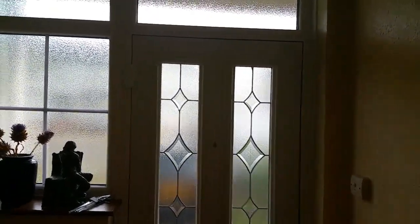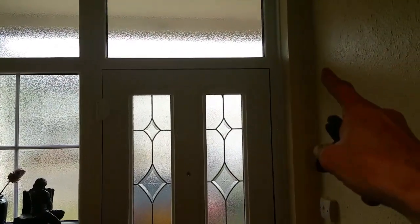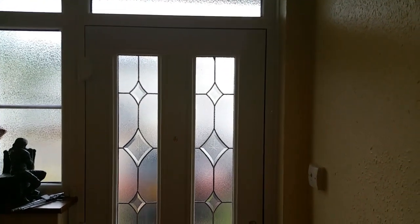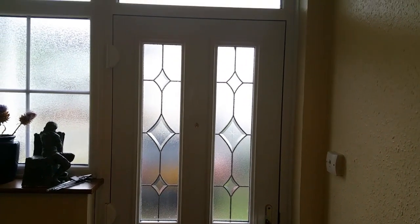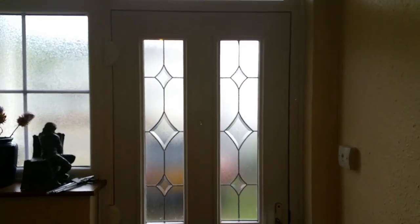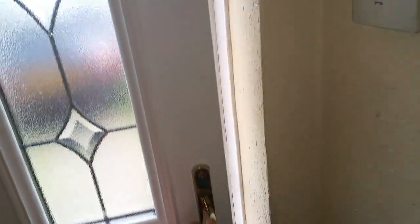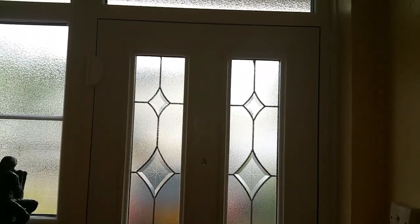The gap has closed up on the left and the gap at the top is a bit more even. The door is slightly warped — if you put a spirit level on the side you'd see that — but it has solved the problem. The door is not catching on the lugs anymore because I've straightened it up by adjusting those hinges.